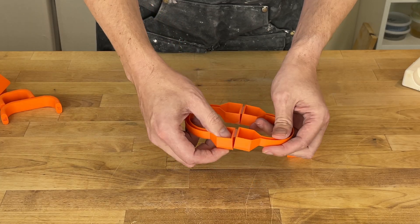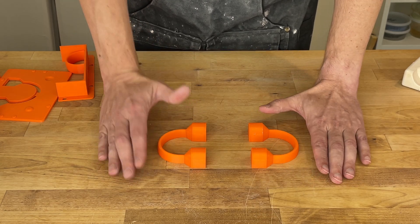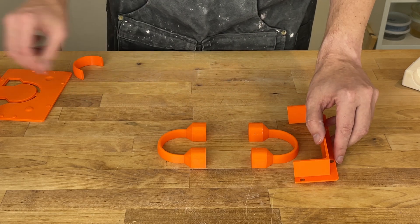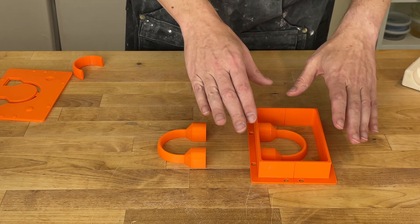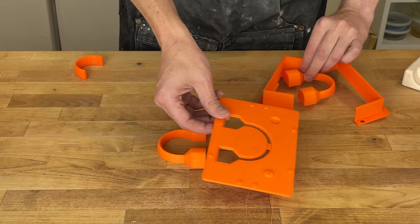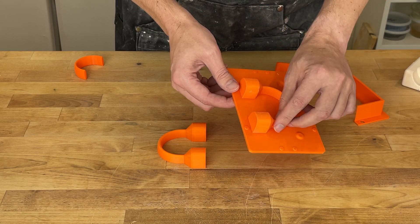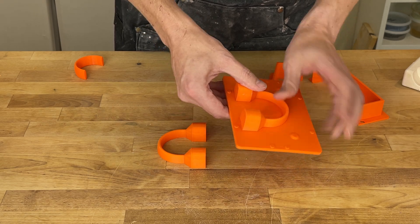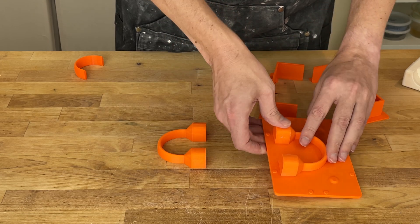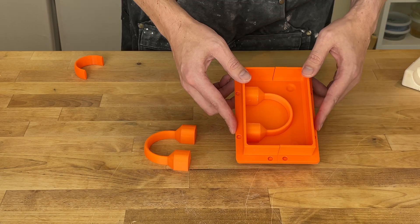With ShapeCast, we actually pour both halves separately — so I should just tape this together for demonstration purposes; it's actually two pieces. The advantage of doing it this way is we don't need clay underneath. We can basically pour against a flat surface. We assemble a wall around it and pour plaster in. We don't want to do that against the bench, so I have a bottom plate here, and this one has a bunch of specific features modeled in that capture this piece. I slightly extended it so it fits down into the bottom plate very snugly, and you can tape it together so it doesn't leak. Then the outer walls fit on just like that, and we'll mix up plaster and pour it in.